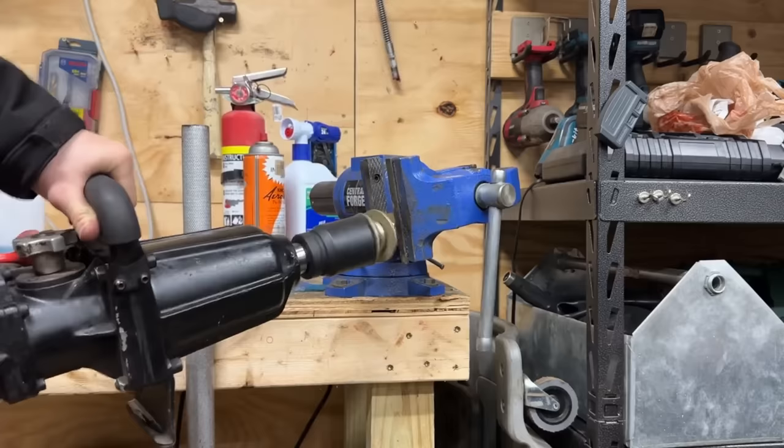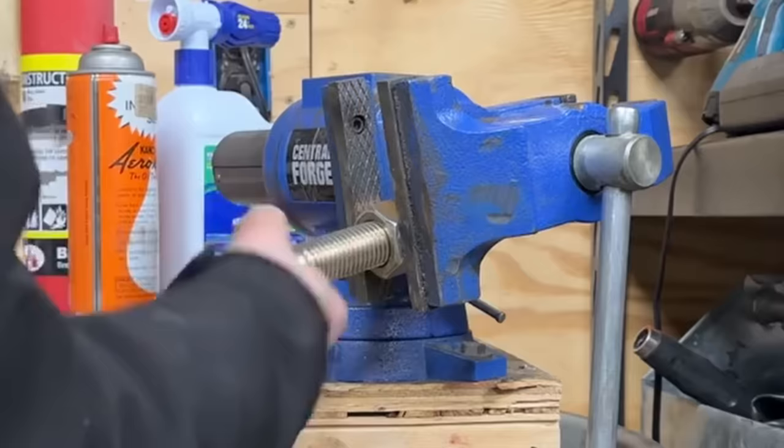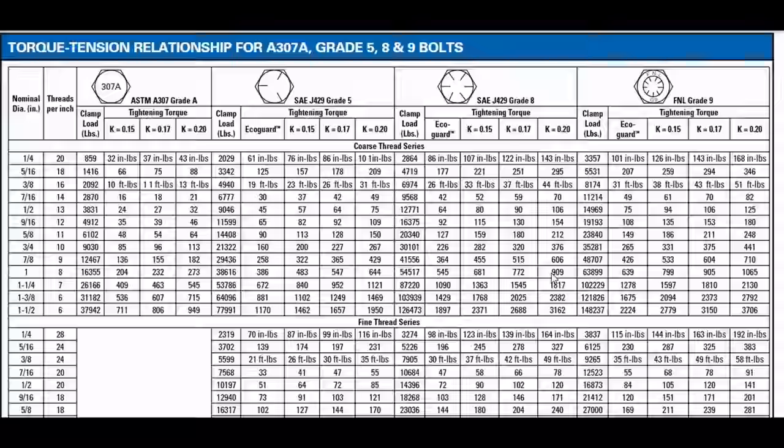That's right, the reason it was impacting while removing the bolt is she's proper foobarred now. Trying this again with a new 1-inch grade 8 thread in a trailer hitch with some tuning adjustment resulted in this. Practically sheared off all the threads in the nut now, so I'd say she understands the assignment, we'll say. The proper torque for a dry 1-inch grade 8 bolt is 909 foot-pounds.